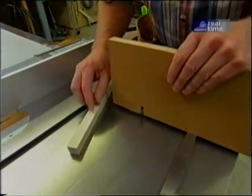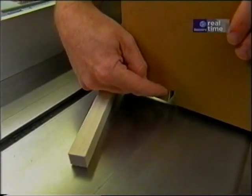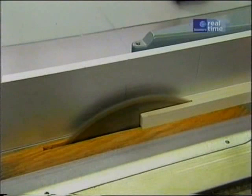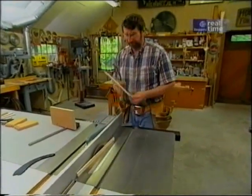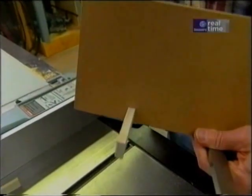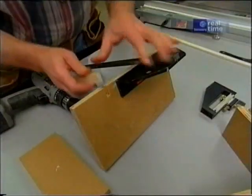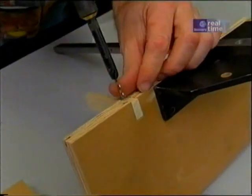The next step is critical. I want to take a piece of solid wood and make a pin that fits that slot exactly — it can't be too loose. So I removed the dado head but left the height adjustment the same because I'm going to need the dado back in there in a minute. I've set the fence for what should be an exact fit. Now let's see how we did — I'd say that is just right. We'll just shorten this stick a bit to make that pin. I'll just slip that pin in the slot, pre-drill a hole and attach it with a screw.